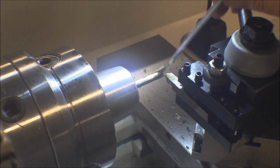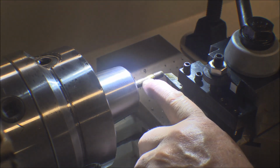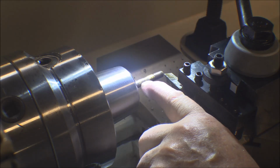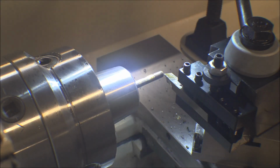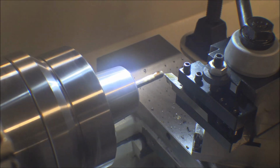These bolts are perfectly serviceable bolts as far as that goes. There's nothing wrong with them. Some of them got a little bit of rust on them and stuff, but I usually change them out when they get a little bit of rust on them and when the CAD plating goes on them. These are CAD plated bolts, and once that CAD plating goes on them, they get rusty real easy and they start swelling up and sticking in the part. I'd rather change out a $5 bolt than a $500 or a $5,000 part.